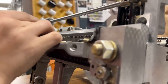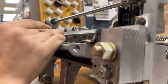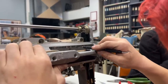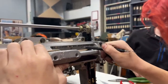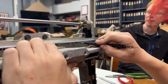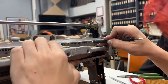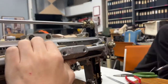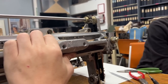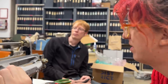Believe me when I tell you that this paper was very stuck in there. Astrid and I spent quite a while removing it with a dental pick. Like, this is hard. Like, this is, like, solid. It's metamorphic paper formed deep underneath the Earth's surface under great pressure and temperature. But that would make sense as to why new punches are getting bent. Because if this was happening for a while, then it was just punching cards until there was simply no more room for the teeth to move.